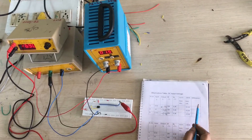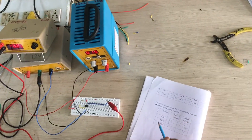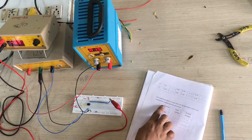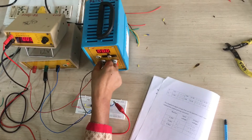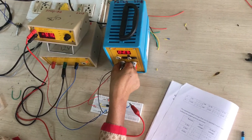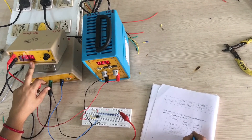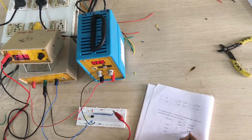We find the difference here and write it down after the practical. The next part of the practical: with Ri at 2.2K, we find the maximum input voltage where the output gets saturated. When a particular voltage is increasing and the output reaches minus 9.71V, this is your saturation voltage. So the saturation occurs at approximately 2.5 volt input and minus 9.71V output.